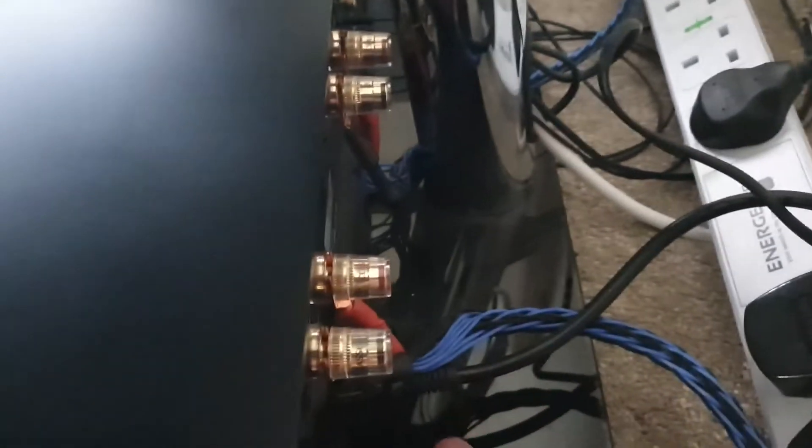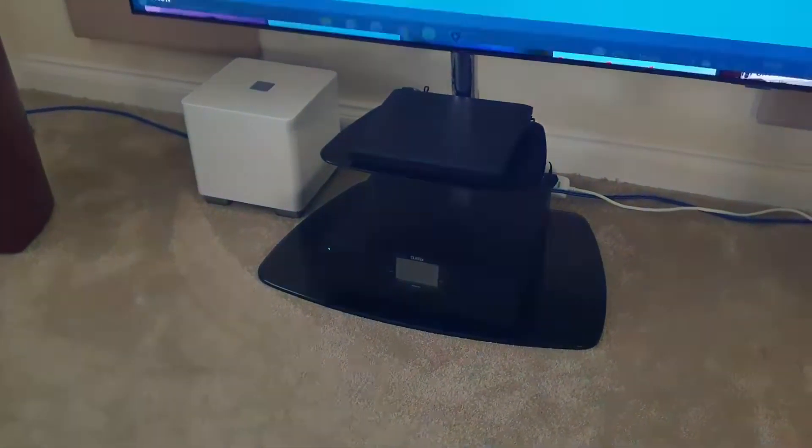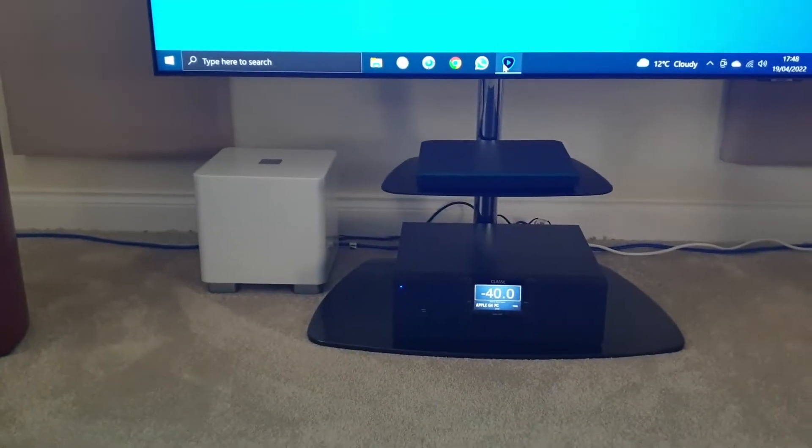So the capacitors and inductor are replaced. I've got the TV plugged in, the amplifier connected to the master socket, and the subwoofer connected to one of the slave sockets. When I switch the TV and amplifier on, that should trigger the subwoofer to switch on. And — hey — that's now switched on! That's perfect, that's great.